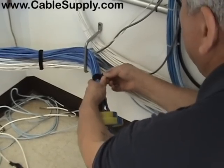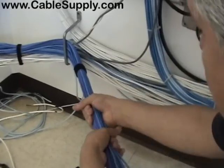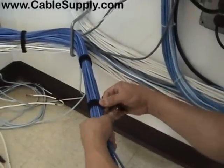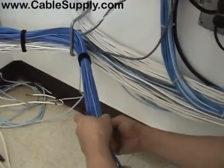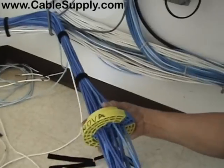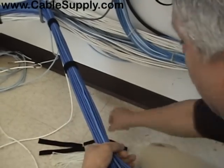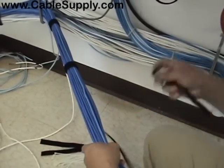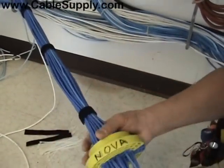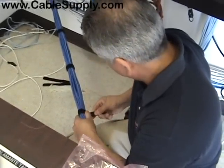They're using velcro in this install. Why do you use velcro? Well, you keep from pinching the cables too tight with tie wraps. You can just use velcro to keep it neat, and also if you're going to add another cable later, you don't have to cut all the tie wraps out — you just undo the velcro and add another cable in. But there's nothing wrong with using cable ties either; you just don't want to tighten them extremely tight because that can mess up the cable itself. You always end up adding cables in the future, and velcro gives you the flexibility.